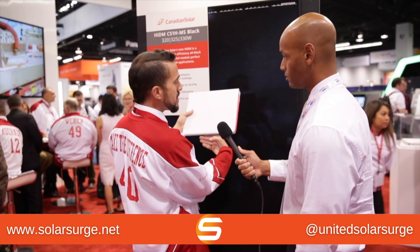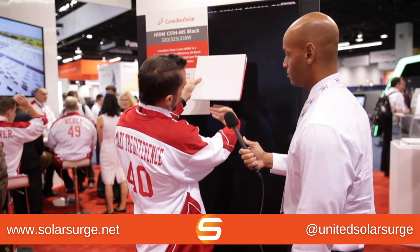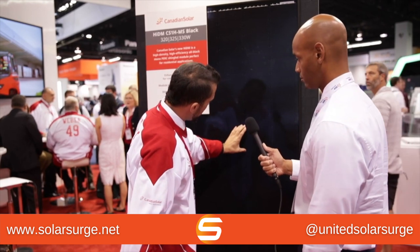So Daniel, thanks for taking the time to talk to us this morning. Tell us, what do potential system owners need to know about the Canadian Solar Black on Black HIDM module? Well, this is the aesthetically pleasing, all black, high density module from Canadian Solar. Our PERC solar cells are actually cut into one inch pieces, and these cells are like shingles where they overlap each other. We have a thermal conductive paste where one cell goes on top of the next cell — that's the electrical connection. This gets rid of the spaces in between the cells, so you get more power density out of this module's footprint.